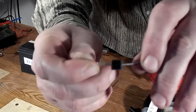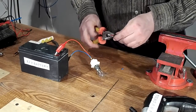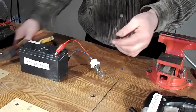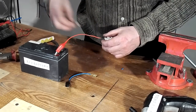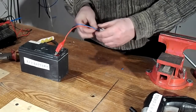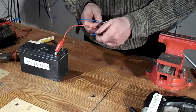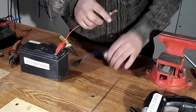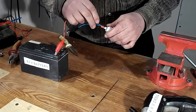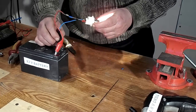How can I make a simple and powerful adapter? I remembered about diodes. A diode conducts current only in one direction, but also has a voltage drop due to the electronic barrier. You need to use power diodes, such as 10 ampere diodes. I connected a diode in series with a bulb to measure the voltage drop on it.